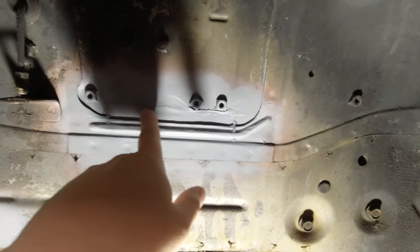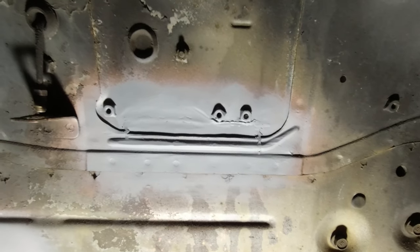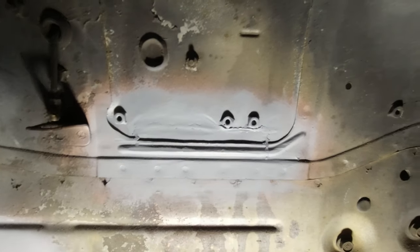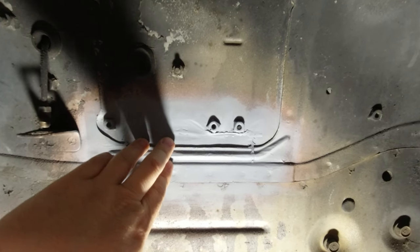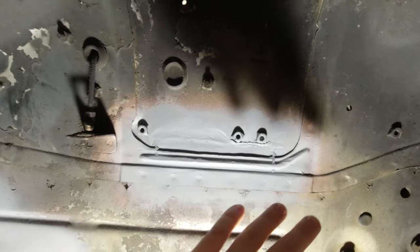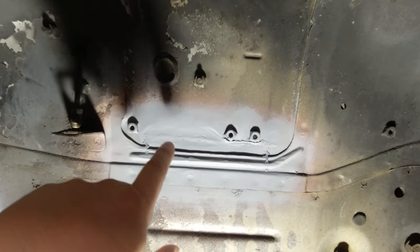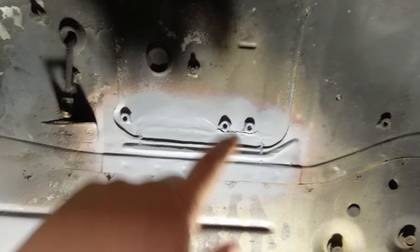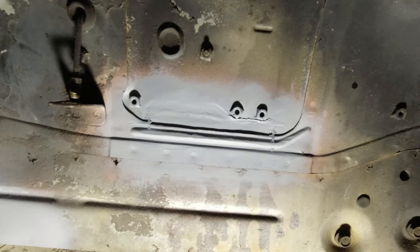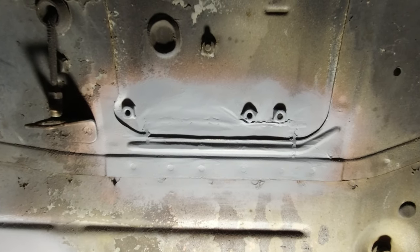The primer on this bit is now quite dry. What I want to do now is actually weld in from the other side just so we can see what reaction the primer is going to have when we do that welding. I know obviously that means I'm going to have to strip this and reprime, but I think it's important to see the difference in how the copper primer versus the standard etch primer handles the heat of welding. I'm going to set the camera up here and you guys can just watch along as well from the inside.